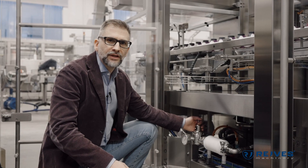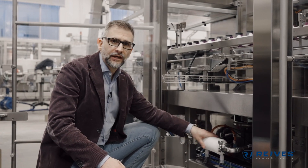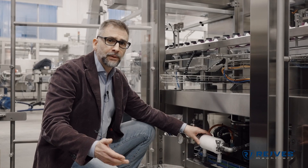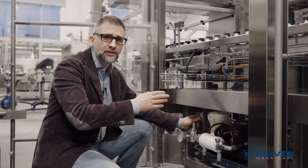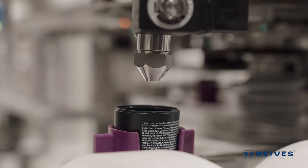This customer wanted to give the best quality to its clients, therefore we have a nitrogen injection and an FDA-approved filter for that. We give nitrogen just before the capping but also inside of the tank, therefore the quality of the product is guaranteed — from the filling process to the shelf, you have the best result. Here is the nozzle that doses the nitrogen just before capping.